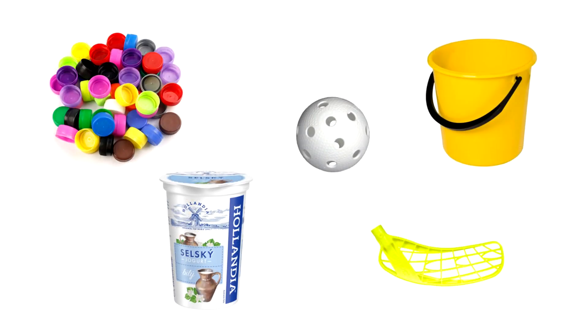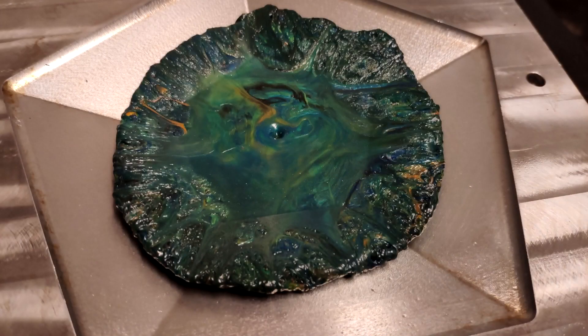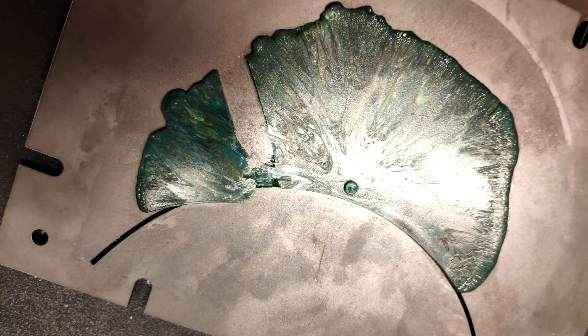Here you can see the product types I usually recycle through the injection machine. PLA, such as these cut filament strings, is nice for compression molding, but I don't recommend PLA for injection molding. Due to low shrinkage and big stiffness, it's difficult to remove parts from the mold.